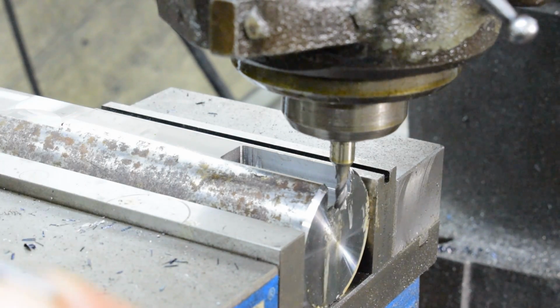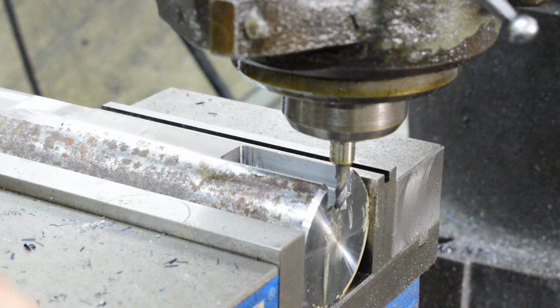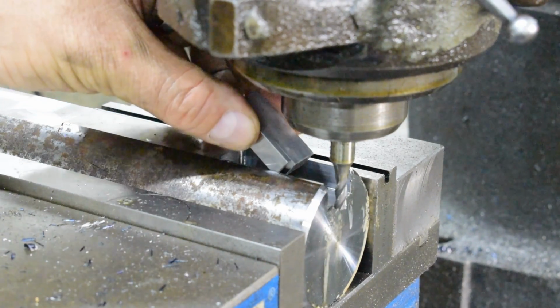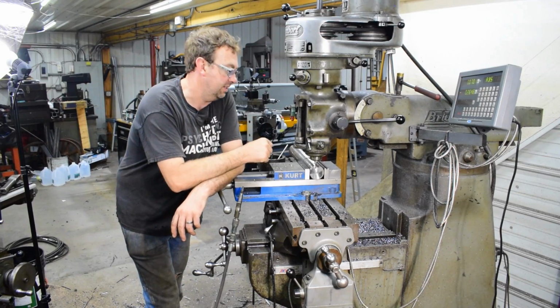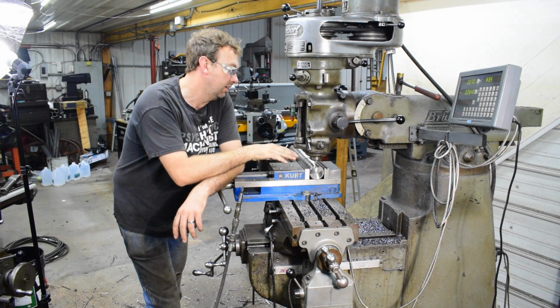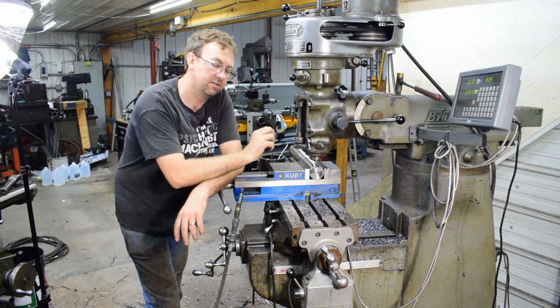So I got a 600 and a 114 here, and that's how I'm getting my 714, which I also measured with my micrometer to make sure that was correct. So we've got about 36 thousandths to go, and I think I'm just going to take that 18 a side. Actually, I'll come down to 17 a side, see where I'm at, and then final touch it off.